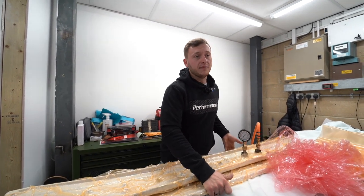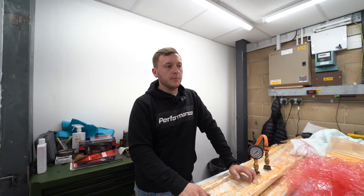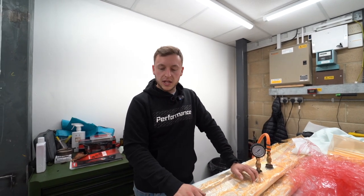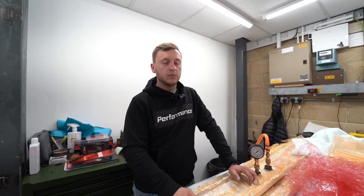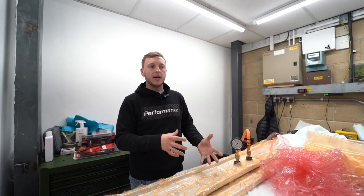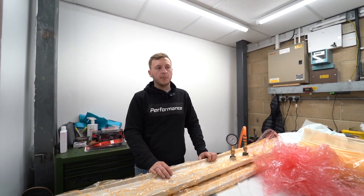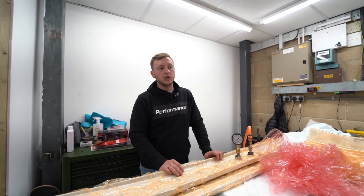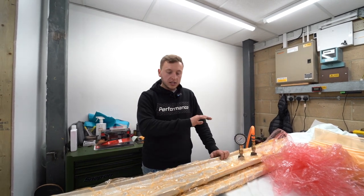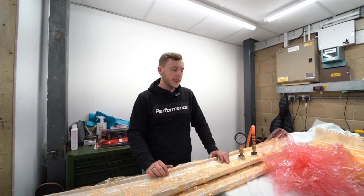Pretty heavy, but these are made of carbon fiber. So touching briefly on the molds, we'll come back over there, but all the molds are made of carbon fiber, prepreg carbon, but just a different material that can withstand the heat and the pressure that goes through making the product. You'll see some products are made in aluminium or steel molds, but the way that they're set up here, we don't really have the jacks and stuff to transport all the molds, so we use carbon fiber molds, and they've been really good. This SP1 mold that's being used at the minute has been doing a year and a half of production. As long as it's maintained clean and the surfaces are really polished before laying the carbon, the product comes out perfect every time.